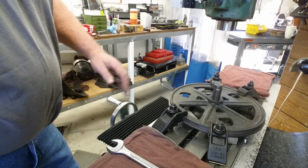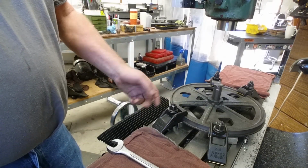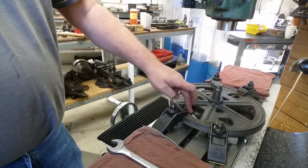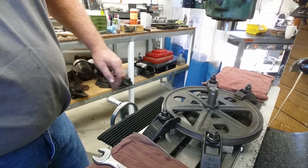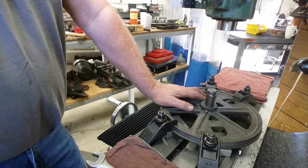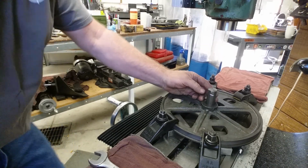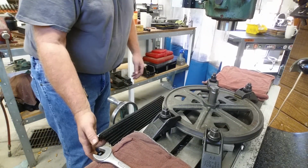Okay, well, we're all bolted down. We cleaned the table, we cleaned our blocks, we cleaned the back of the part, and we're pinned down in 4 places, and we're down tight on all the parallels. So it's as close to being true as we can get it. We're getting ready to bore the center and true up on the center. So let's kind of eyeball this turkey here. Let's bring the table up a little bit.